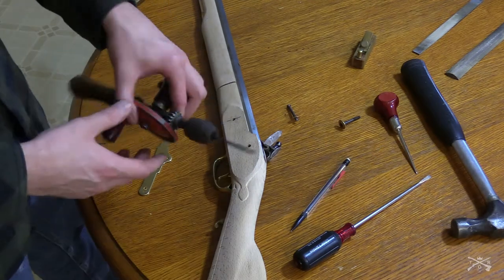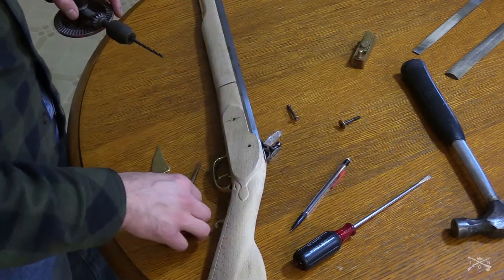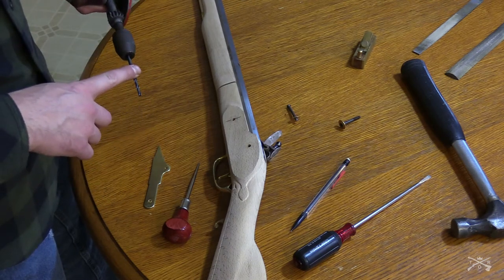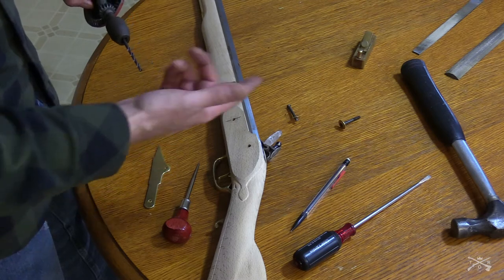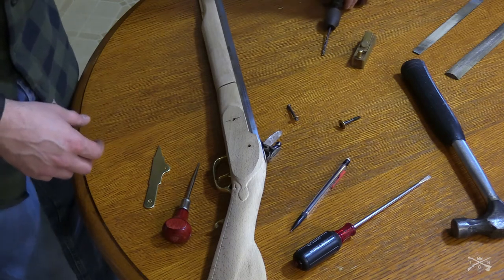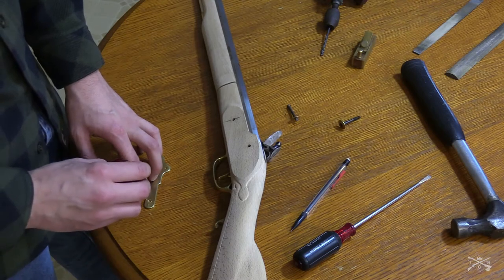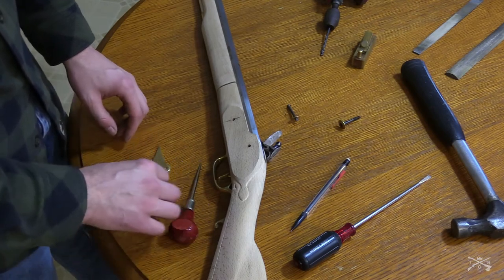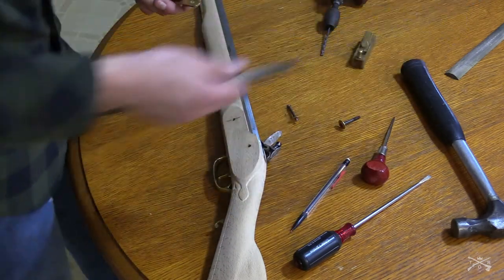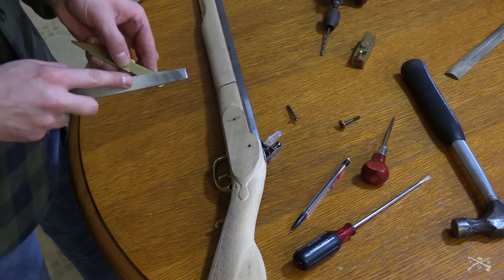The hole's been drilled and this is the drill that I used. I just started with a small drill bit size and worked my way all the way up to this one, which I think is the 5/32. That just happens to be the size of my bolts. When using these drills it helped because it wouldn't drill all the way through, so I just used the awl to punch the hole all the way through and then I was able to finish drilling. I'm just going to use a fine tooth file here to get the rough edges off.